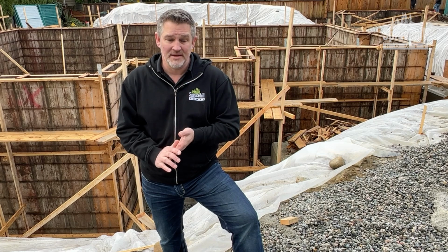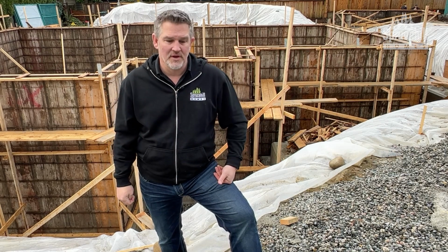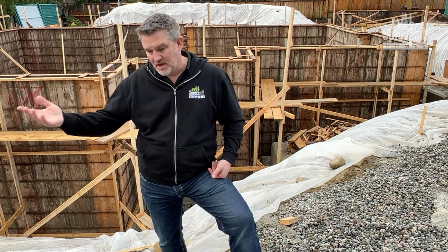we're gonna do spray foam on the ground. We're going to do spray foam up the wall, which again, not great, not easily recyclable, but it solves a lot of problems from an air tightness perspective. But at least we'll be able to remove the spray foam from the inside of the concrete walls, and that should be able to be just very easily scraped off the inside of the walls. There's no plastic strapping or anything like that that needs to get scraped off of both sides of the concrete, and the rebar and everything else can be taken out of the concrete, and the metal can be recycled and the concrete can be recycled.